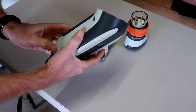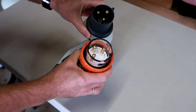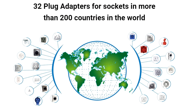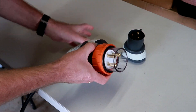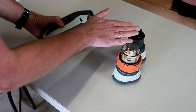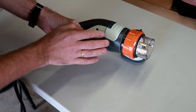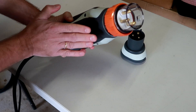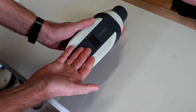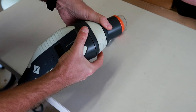So in today's video I want to show you what's going on. You have the charger unit itself with the industrial plug on the top with the connector, and then you get all kinds of different connectors worldwide to fit any power outlet you can imagine. Depending where you plug in and where you are in the world, you get these different adapters — I think they have over 30 different adapters now. Because this is a prototype, they don't have all the adapters. So when you connect the charging unit with one of these adapters, the electronics actually sense what kind of adapter you have plugged in. The electronics now know this is a 32-amp adapter and will give you the option on the display to go all the way up to 32 amps. So the maximum current on the device is determined by the kind of adapter you plug in.